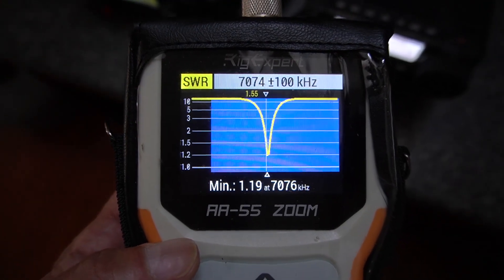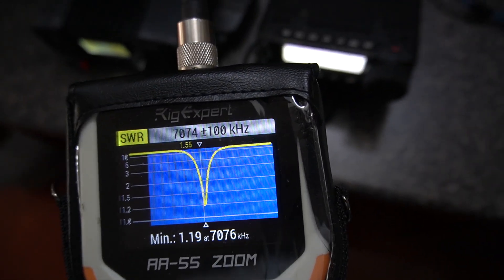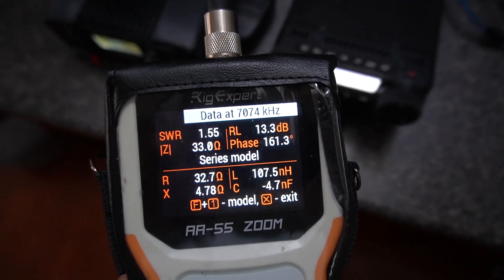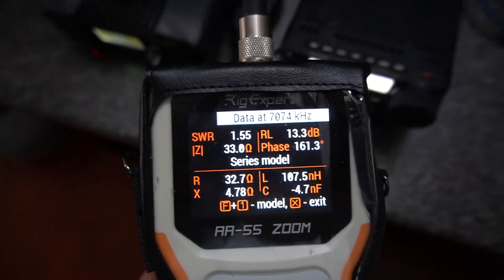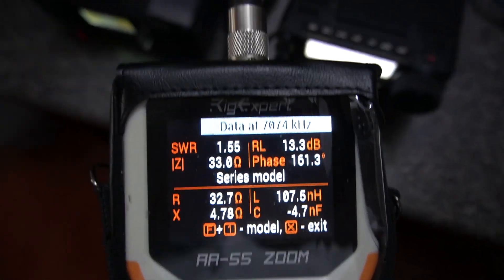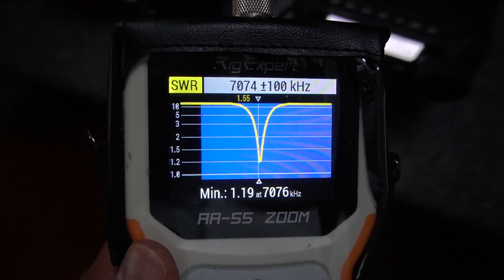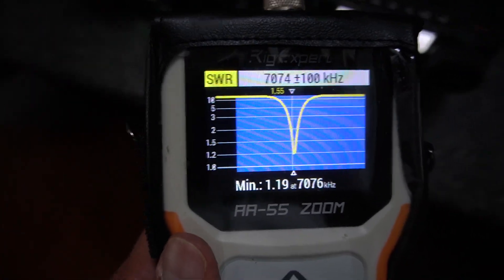On 20 meters, as you saw, I was able to make some contacts. On 40 meters I'm not sure what I'm going to get because at this time of day I'm not sure if anyone will be there or if they'll be able to hear me. Here's some of the data from 40 meters — return loss 13.3 dB. That's not really good; I mean, probably getting out maybe 40 to 50 percent, at 33 ohms. If I could tune it to 1.19 SWR, that 13 dB would probably be like 20 dB — that's how a little adjustment here and there can make a huge difference. As you can see, this is not easy. This is the frustrating part of the magnetic loop antenna.